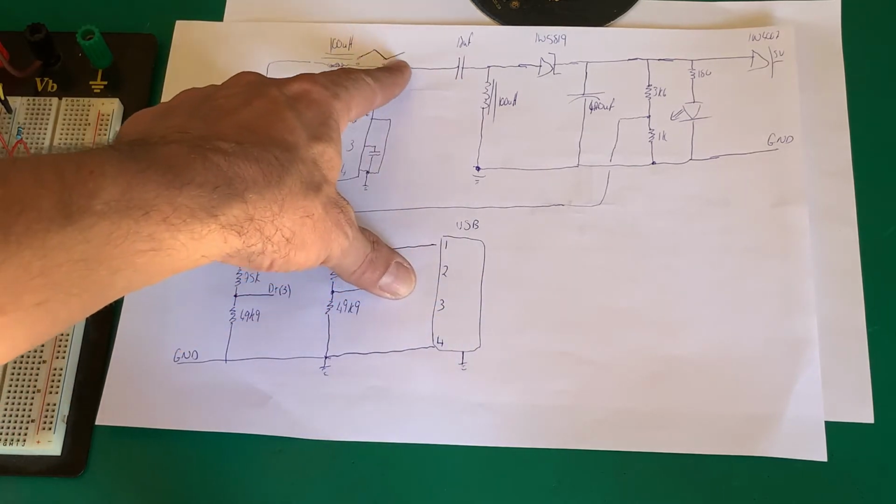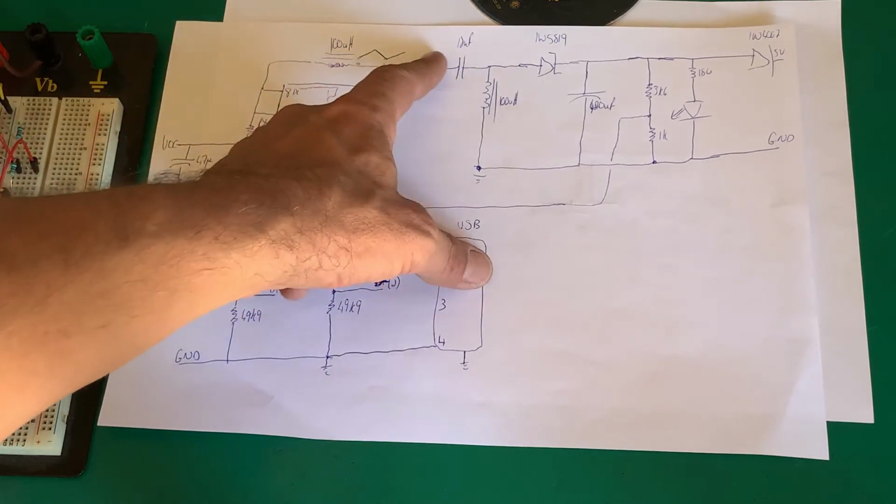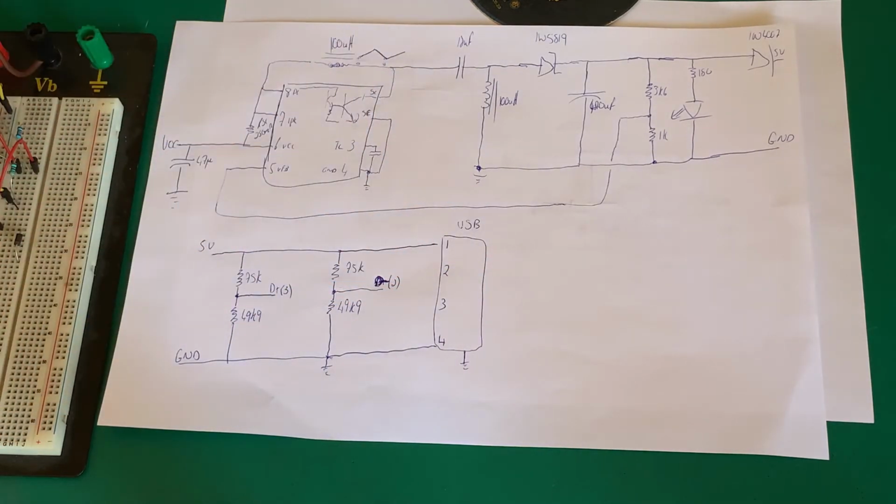Remember, this is going to be a pulse doing this the whole time. To all intents and purposes, that square wave is AC. The capacitor will pass it. But if it can handle that ripple is how well it's going to pass it. If it can't handle the ripple, well, you're going to lose efficiency.